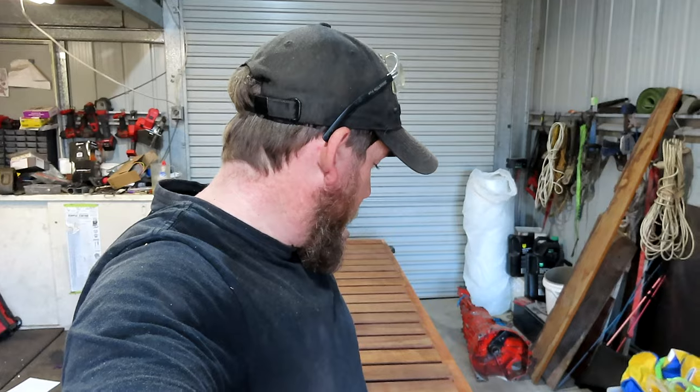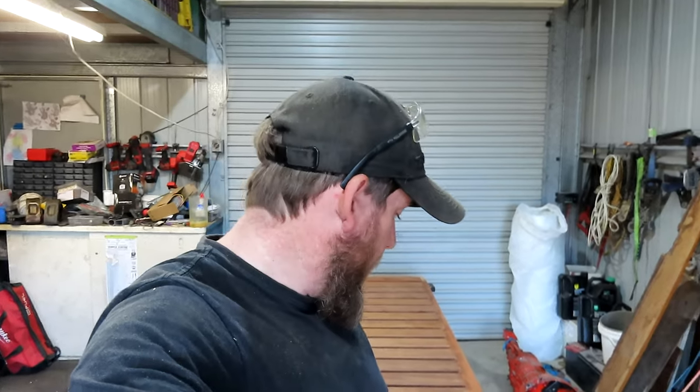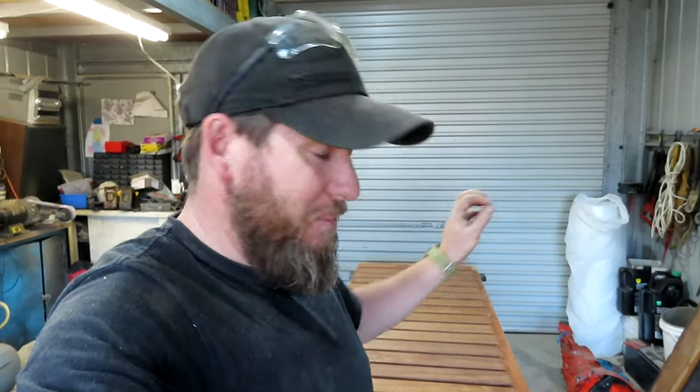When you're talking about 23 spaces, including the end, that 0.3 accumulates out to 6 mil. So it really kept throwing me. I went back and forth and did the math. I'm like, it should be working, and it's just not. So anyway, what we've got here is a space of 23 mil between each plank, and it works beautifully to the millimeter.